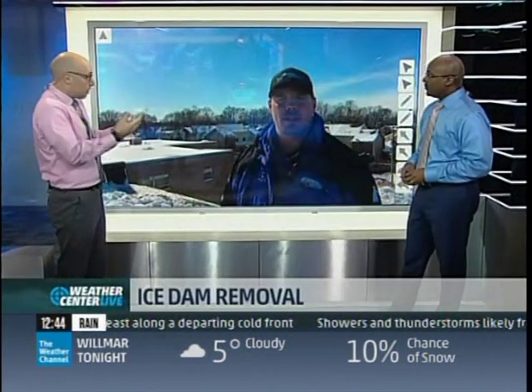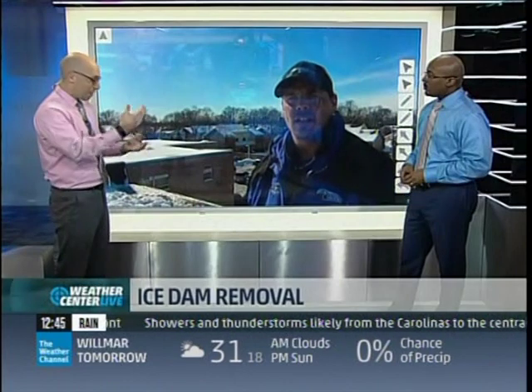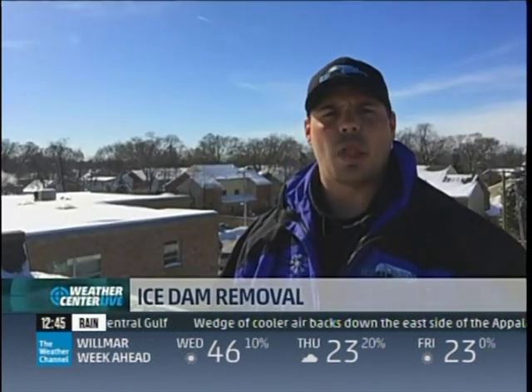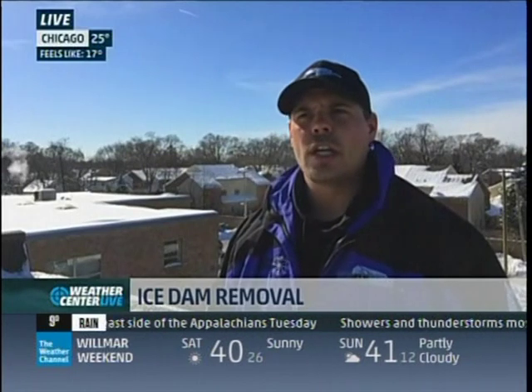Your view from your perch above is epic — you can see all the roofs and the snow behind you, but that means you're up in the weather. These ice dams often happen when there's more bad weather coming. So what are you worried about when you're up there on the roof? If the ice dam is still there and blocking flow off the house, and warmer weather or rain comes in the future, it's not going to have a chance to escape off the roof — and that's when you're going to see bigger backing up and more leaks.